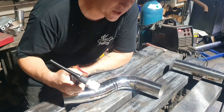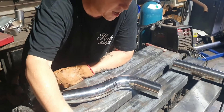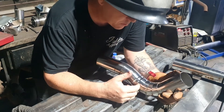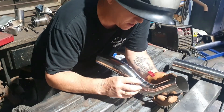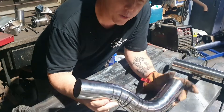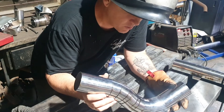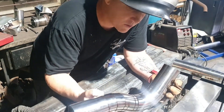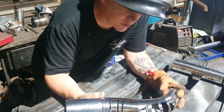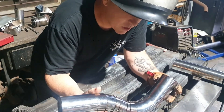The fact that I dipped my tungsten about four times there — you'll notice I'm running a pulse setting. I've currently got 50 hertz or 50 amps. I just find that when I'm tacking the pie cuts together, the pulse setting is really, really nice. It just helps with the two metals joining together without having holes and stuff like that, without the need for filler. I've actually been welding a fair bit lately with pulse settings at very high frequencies around 50 hertz. I just find that it gives me a lot more heat control when you're doing continuous runs like this. The material heats up significantly doing so many welds so close together, and the pulse just helps you control the heat a little bit better.